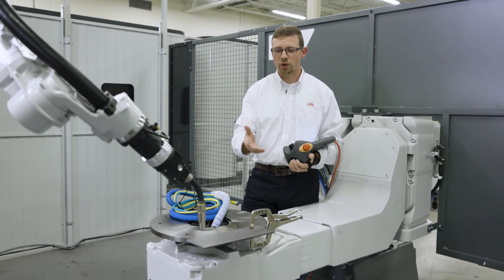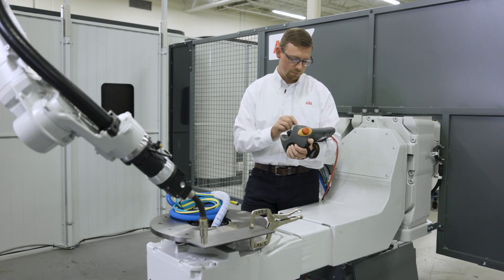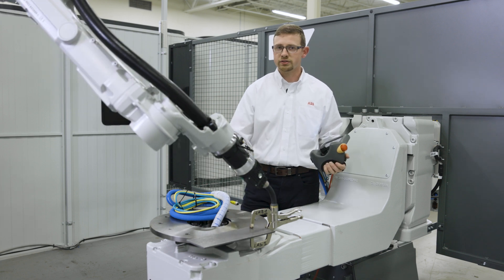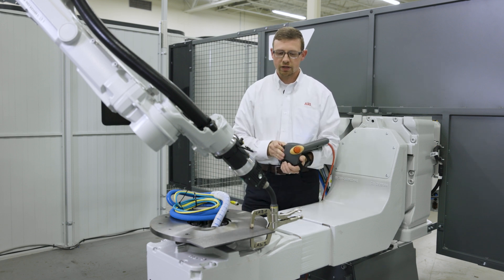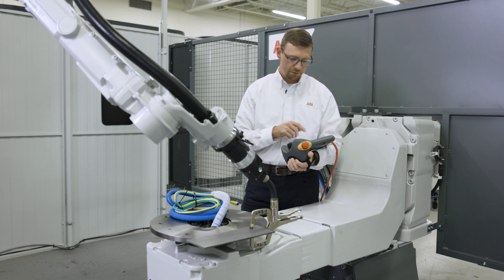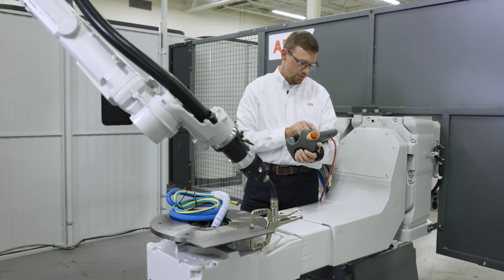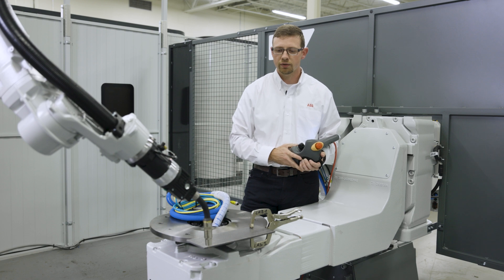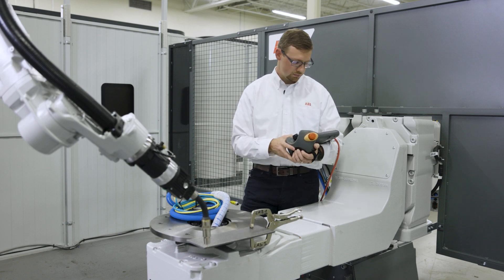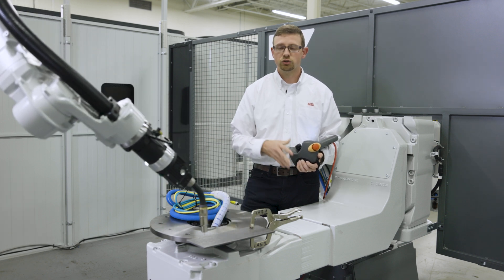Here we are inside one of our FlexArc cells where I'm going to demonstrate SmartTAC. The first thing I'm going to demonstrate is the representation of a weld — we have a start point and an end point, that's typically a weld. Now the problem becomes if we were to move the part. SmartTAC uses a 1D search instruction which searches one dimension. Here we have our start position for our search, our end position for our search, and you can see the contact. We have start, end — that would be your search.